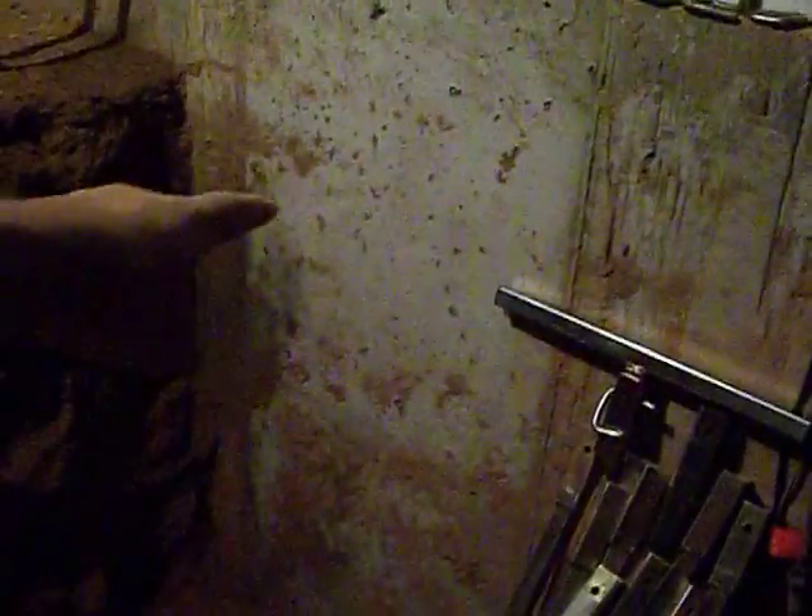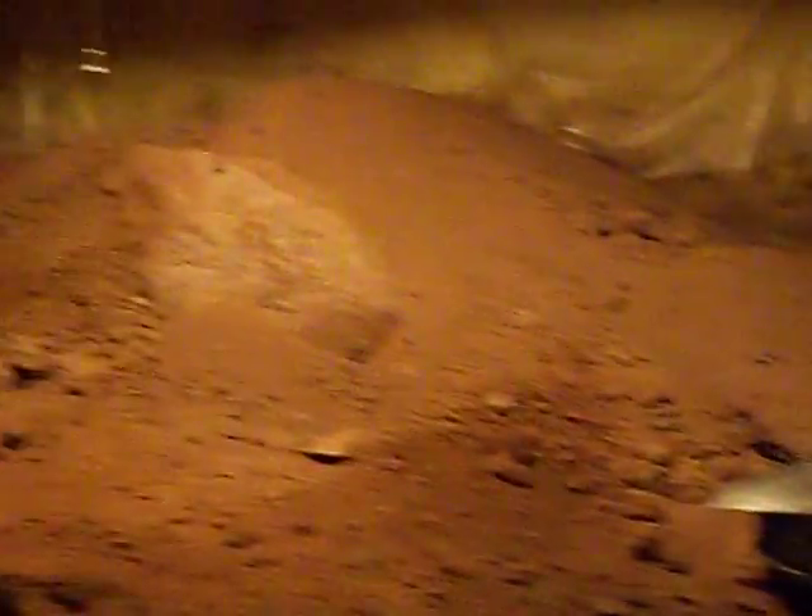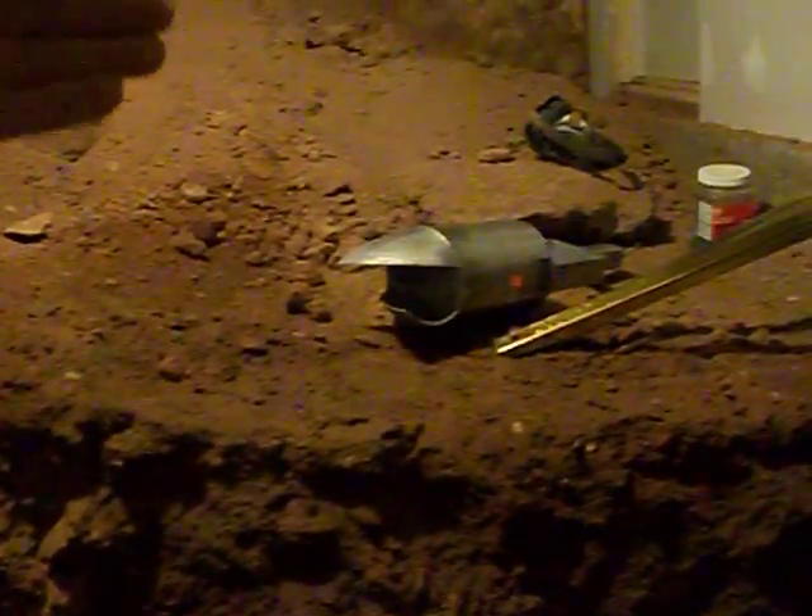That's my theater room — just trying to give you an idea. This is a basement crawl space. If it were just a pure crawl space I could do the same thing, but the only difference is if there were no half-wall here — this three-foot half-wall of foundation — I would just dig in the center of the crawl space and offset the footers by a three-foot 45-degree angle. In this case I came back offset at three foot and another three foot because I knew my hole was going to be three feet deep, so I came off six foot and started digging down at least about three foot — just enough room for headroom and so the auger has enough room to pull out the pipe.